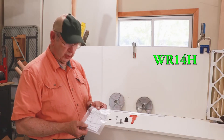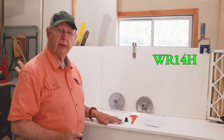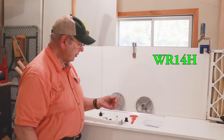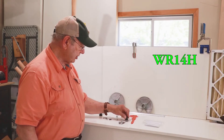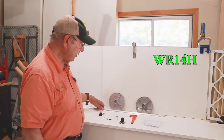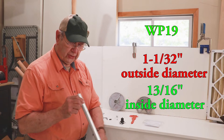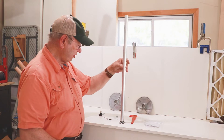The hardware pack includes easy-to-follow instructions to install this set of hardware called the WR14H. Pretty simple — you have a bottom plate which screws to the floor of your cabinet, and then a small ball bearing that drops into that for a pivot. On top of that is a high-impact plastic piece that sits right on top of the ball bearing. And then this pipe, called the WP19, is an inch and thirty-seconds in diameter with a thirteen-sixteenths inside diameter. Set it on there and it rotates very nicely.